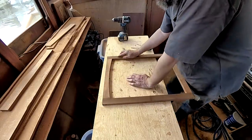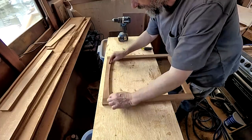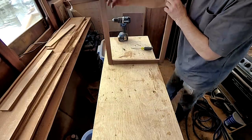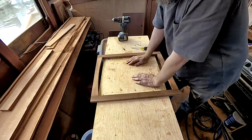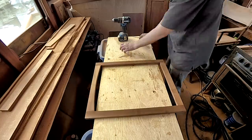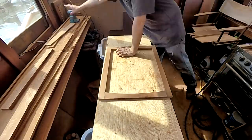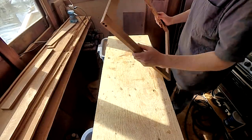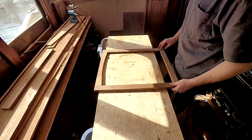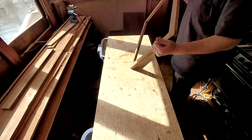So I'm just going to give it a quick sand because I want it really flat to cut that dado in the router table - flipping it over and using the fence against the outside edge to cut in about a quarter of an inch and about half an inch deep. At the top, you say - how are you going to cut a curve? Well, you don't cut a curve. You cut it square and the glass is square or rectangular anyway and it sits in the slot. From inside the door the glass is straight; when you look at the door from outside it appears curved but the glass is actually straight across inside. If that's a level of fakery that's intolerable to you, I apologize - I'm not cutting curved glass. So let me get this sanded up a little bit so it's good and flat.